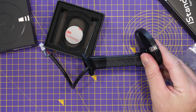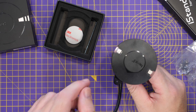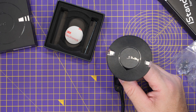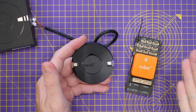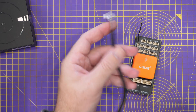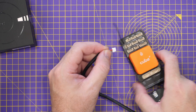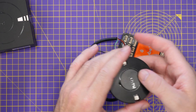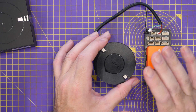They do still have a downloadable 3D printable version of this if you didn't want to buy the stand, but you also have this nice fully-fledged carbon fibre stand now available from them. The Here 3 Plus is designed to be used with the Cube series of autopilots. I've got here the new Cube Orange Plus as well, and it simply plugs in via CAN bus into our autopilot. At the moment we're only using the single CAN port, and it's nice and easy to configure — you simply plug it in and it uses the new DroneCANprotocol that has been made available in ArduPilot.